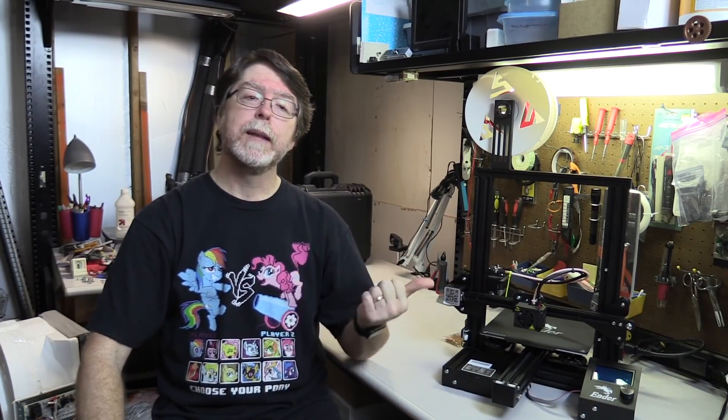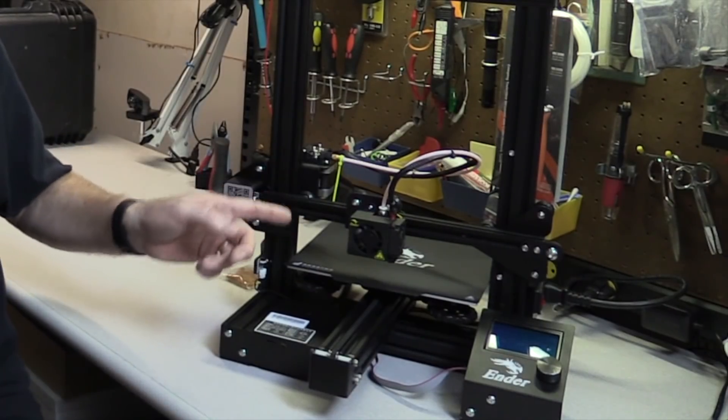Once we have these installed, we're going to need to adjust the bed height again, because installation requires removing the bed from the Y carriage it rides on. Something nice to have, since the Ender 3 Pro doesn't have a bed leveling assistant in firmware, is a G-code file from my friend Peter Solomon at Wham Bam Systems. He pointed me to this file a few months ago and it's linked in the description. The file is named Ender3Level.gcode, and it moves the nozzle to each corner in turn and then to the center of the bed, with a delay between each move so you can make adjustments. It does about five laps around the bed, with the delay getting shorter on each lap. Pause the video, download the G-code file, put it on your printer's microSD card, and then start playback again.